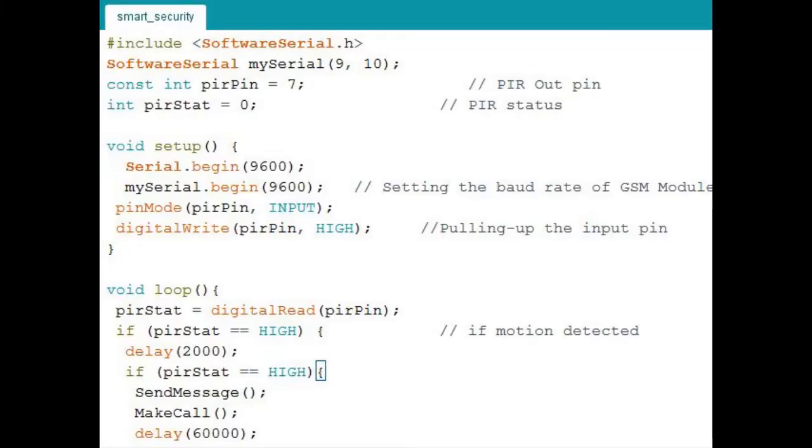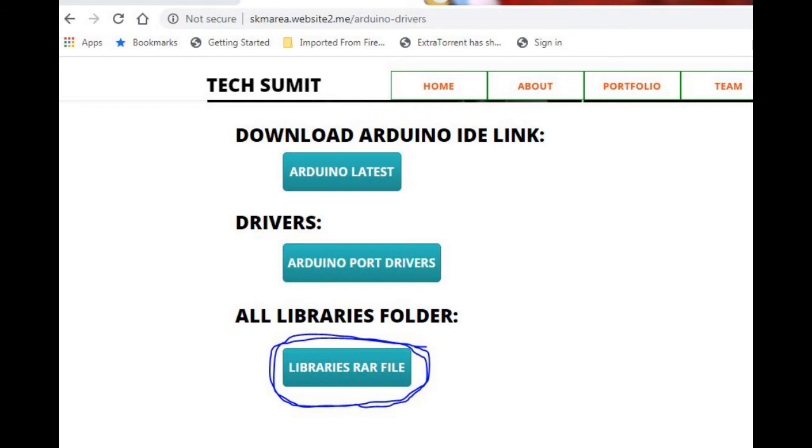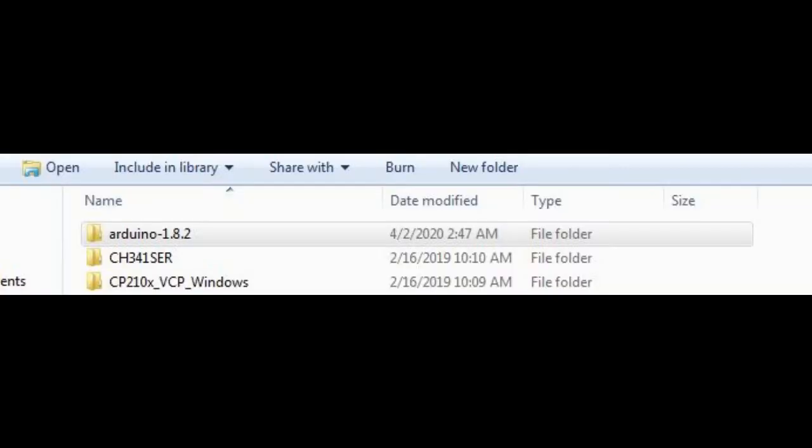Guys, in the software section, in the first line, I have included one header file called SoftwareSerial.h. If you download Arduino from online, you may not have this library. So you have to download it. I have given a link in the description. Download the libraries from there. After downloading, just unzip the RAR file. In that, you will see the library folder.